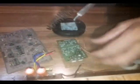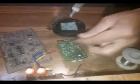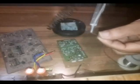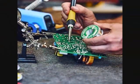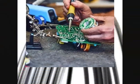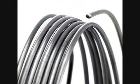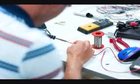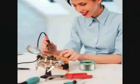Solder required for repairing electronic devices such as boards and kits is 63% soft solder, which means 63% tin and 37% lead. Inside the wire there is a substance called flux. The flux removes the oxidation of the tip and cleans the surface involved in the melting process.